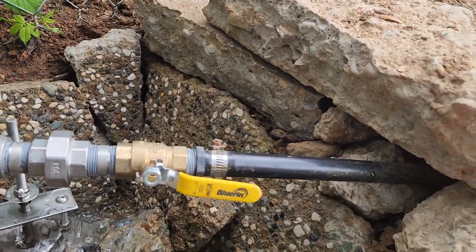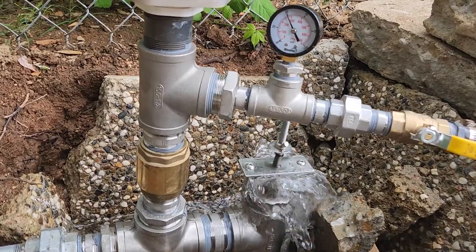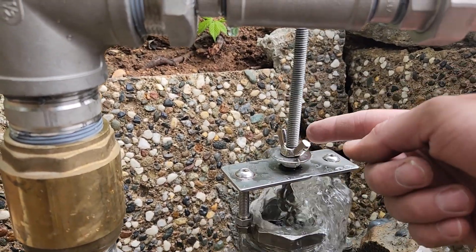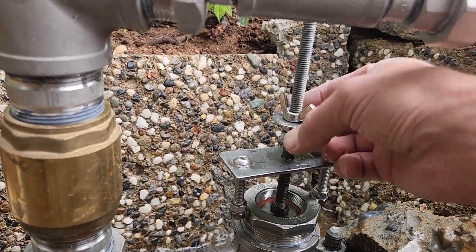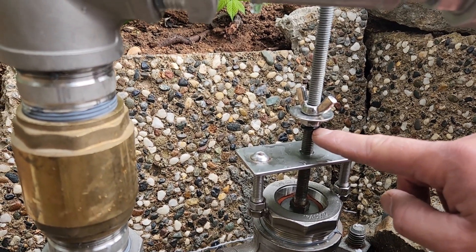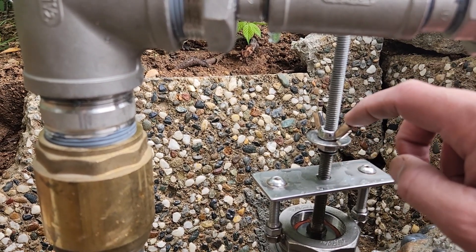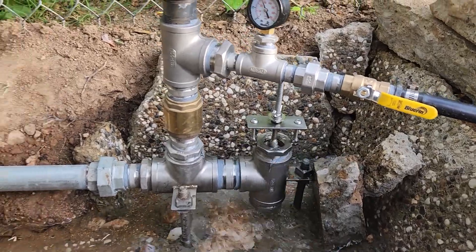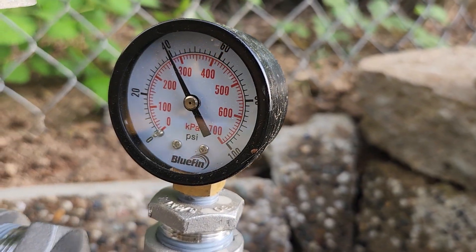The water is going down 80 feet vertically. I will do some experimentation by adding weight here to make it heavier, and also adjusting the travel distance. In the closed position it drops down to this o-ring — this rubber bumper — so that's the distance this piston travels. You can see this pump working; it's a hydraulic ram pump operating at about 30 psi.